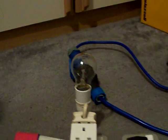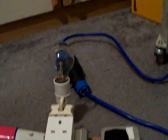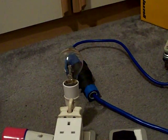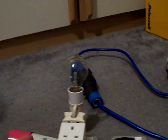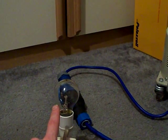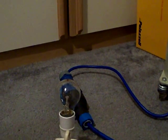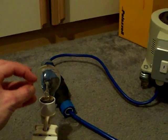We're not concerning ourselves with any loads on the variac right now — just looking at getting it soft started using a light bulb. You're probably wondering: does that light bulb actually light up during startup? Yes it does. It depends on where the AC sine wave is when you turn the variac on. Sometimes it just lights up a nice dim glow, and sometimes when I turn the variac on it lets out a yellowish flash and then dims down to a nice warm glow.